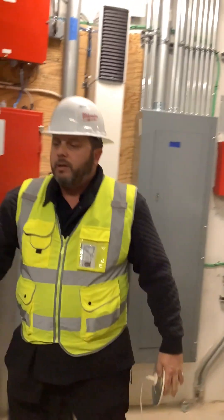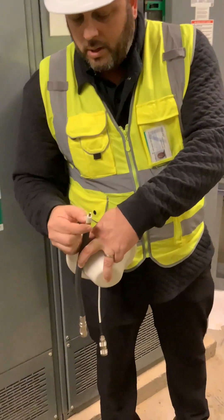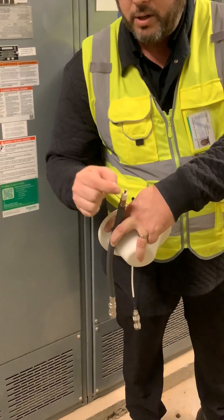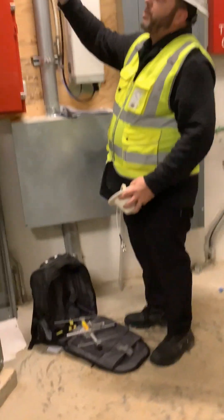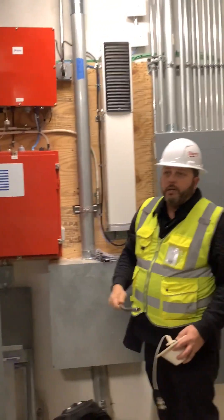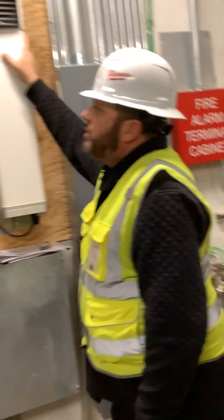This is basically what you're looking at as far as these cables. This one's actually an outside cable because it's full foam. These cables here have copper outside and there's what they call dielectric — it's a little thinner with little coils that go around, and this is that center pin. These are usually the connectors that we use. Here's all the different splitters — splitters usually tell you either they're going to another splitter or they're going to an antenna. This should be all labeled.